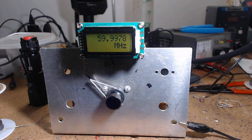If the digit is near the bobbling point it could bobble at a 20 Hz difference. So in order to really check out your huff-and-puff circuitry you really need a good frequency counter. I have an HP I'll probably get out. What I wanted to explain is: just because something's digital it doesn't mean it's accurate. That's the case here — go read the specifications on the eBay frequency counter.